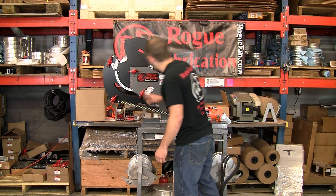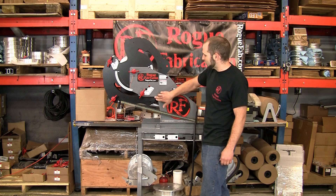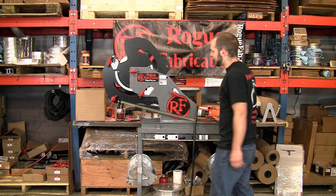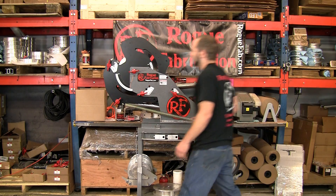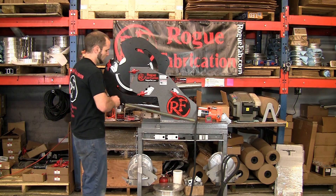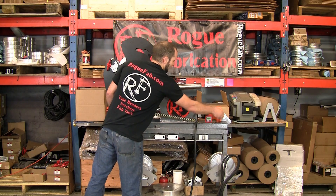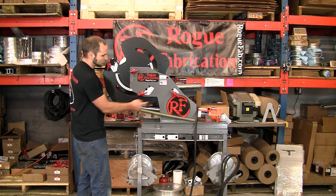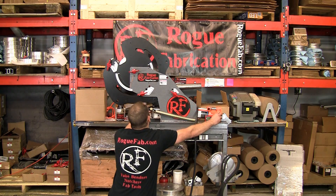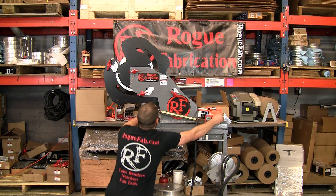Okay, that's to about 75 degrees. The only trick here is this hole has to be past this ridge far enough that the spring back won't pull it back into the machine, so it's probably there about. You release the pressure on the ram and then you retract the ram until the hole is in line with this one, which is probably about right there.